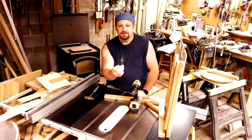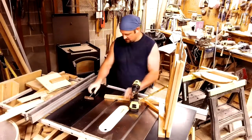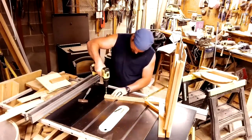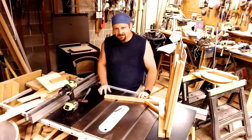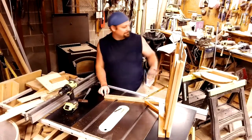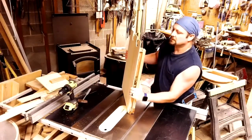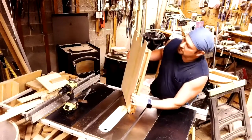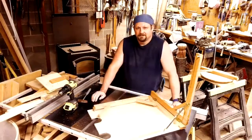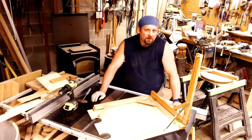So I set this drill bit up with a stopper on it so it doesn't go too far and poke through the outside of the frame. First, I'm going to tap a little hole so I don't go off course. And if my measurements are correct here, I should be able to tap a regular size peg in here, and it should have enough room to clear at the back side. Closes tight with enough clearance. So I'm going to put the last coat of polyurethane on this, and then I'll meet you upstairs to install it on the wall.